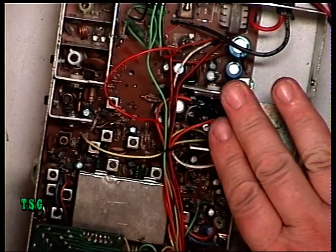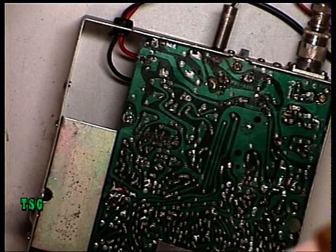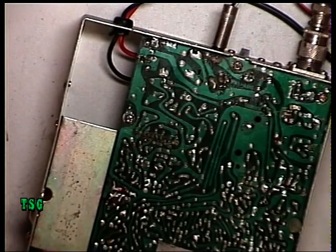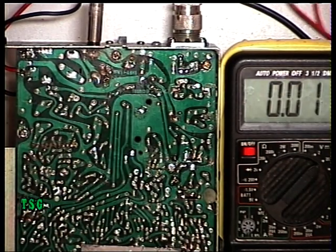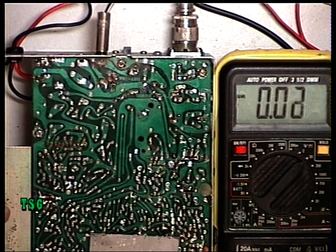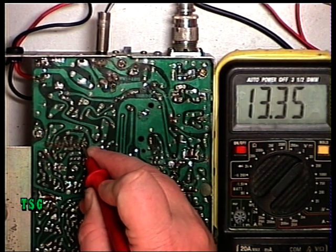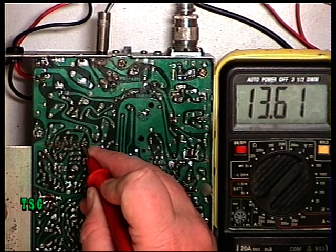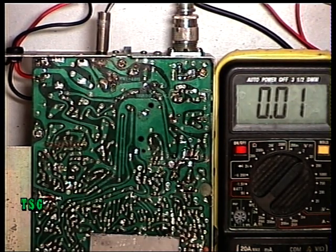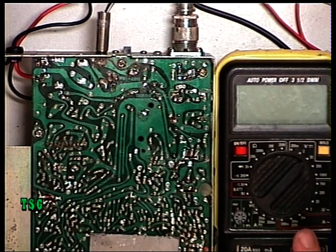It's possible the audio pre-amp runs through the audio chip. I would suspect if we put power to that — which I'll just check — it's a TA7205 on this radio. So the meter is there — this is a negative chassis, not floating. Pin 1 is that end of the audio IC and we've got full rail voltage. With no switch-on thump I suspect it's probably had reverse polarity — bear in mind this radio had no reverse polarity protection diode until I just fitted it. We don't know where it came from; I bought it as scrap. So I'm going to change the audio IC.